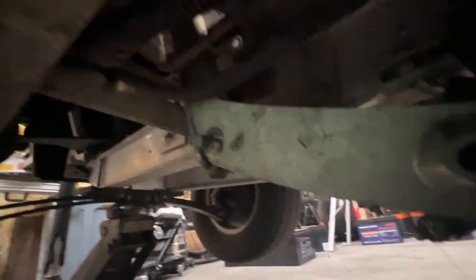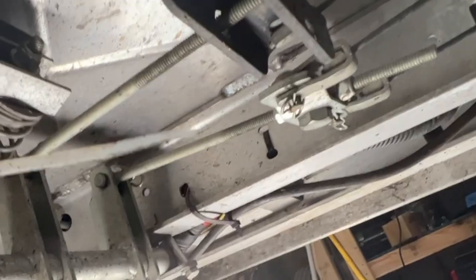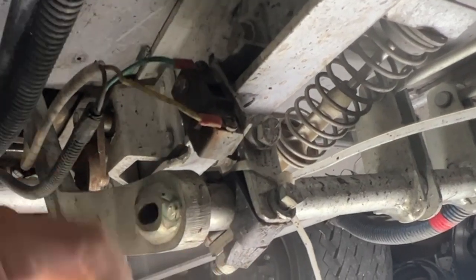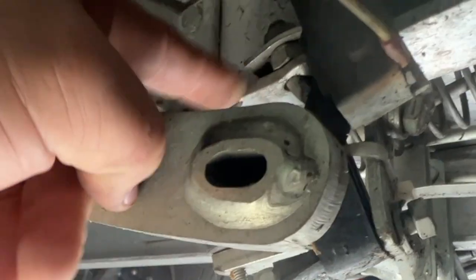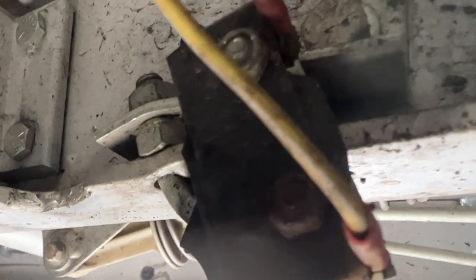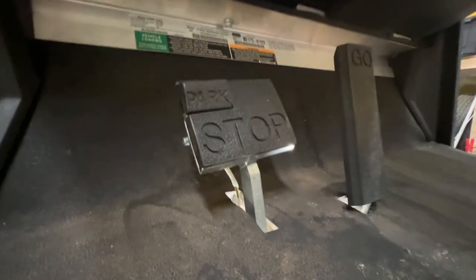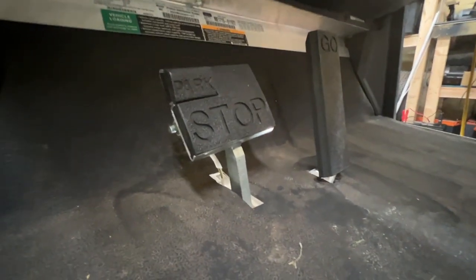The latching system looks like it's in place, but I can see what's happened now — this piece has broke off the frame, and it looks like it's broke off the frame on the other side as well. I might need to get somebody to re-weld this portion where it broke off. It's completely missing the bushing down there altogether, which would explain why it's leaning like it is.